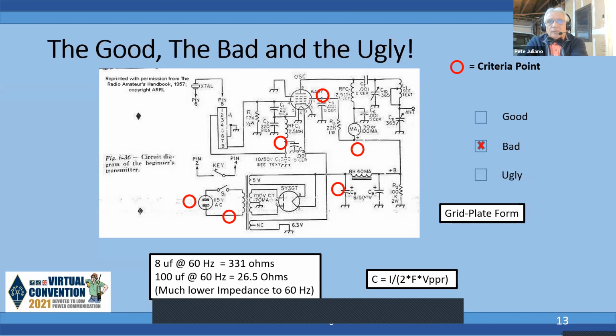And right above the filter capacitor is a 100 milliamp meter, 50 or 100 in a plate circuit. Now, you're very careful when you build everything in a chassis so that nothing is exposed, except you put the plate meter right on the front panel, right square in the middle, and there it is, 350 volts right on the terminals of that meter. It's going to nail you. So unless you put some protection around that meter, I'm kind of against putting plate meters in there because there's other ways to measure the current. You could put it in the cathode and that would certainly do it.